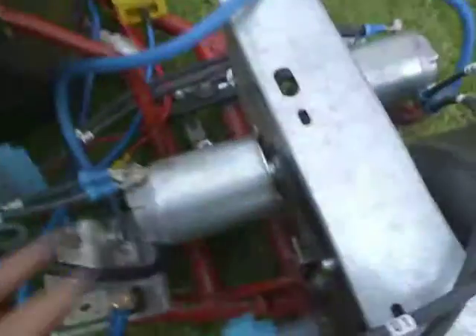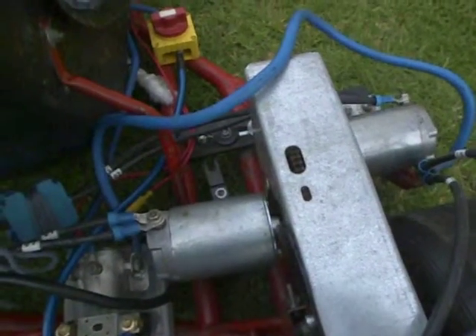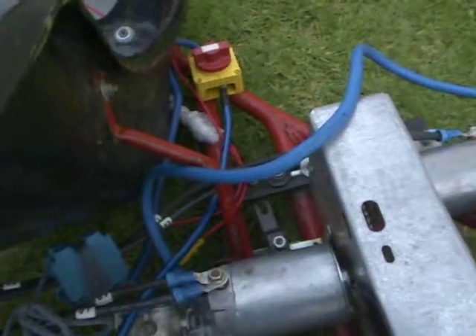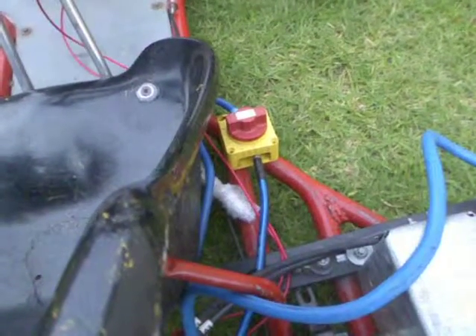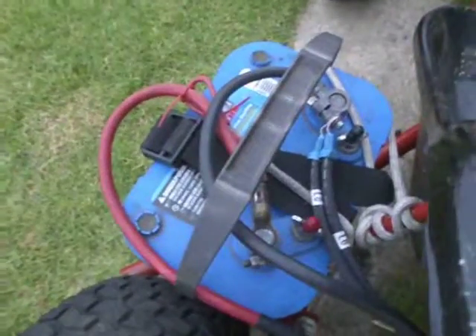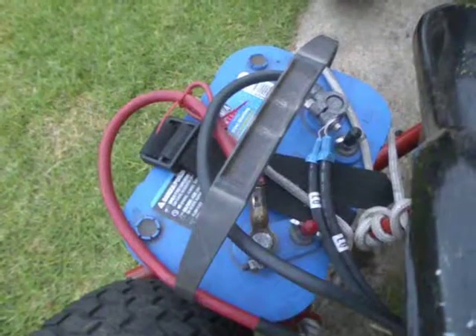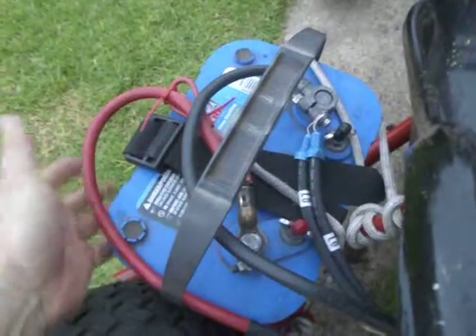I've still got the two motors connected electrically in parallel, and I used it as an opportunity to measure the current being drawn whilst accelerating. I had a clamp meter around there, put a camera there, and measured how much current was being drawn. It drew close to 800A on some instances when the battery was fresh. I also took some measurements of the voltage drop, or sag, and at one stage it got to as low as just above 6V — that's how much voltage sag this battery is incurring when trying to power my dual-motor electric go-kart.